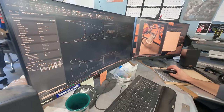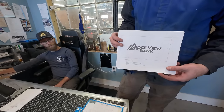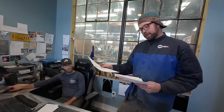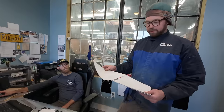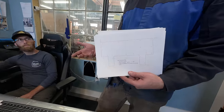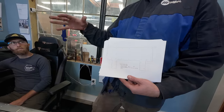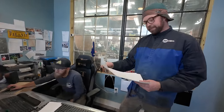And so there's a lot of CNC plasma use here. We're cutting out the company's logos on these 3/16 sheets that'll go on the side of the central cube. And then we're using the plasma cutter to make a bunch of mounting plates like that, which when the base is done, Black Dog can use these plates and all these holes to screw on this giant live edge wooden top that will go on the table.